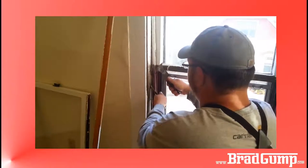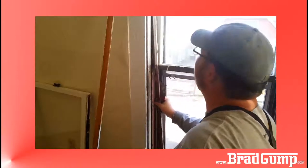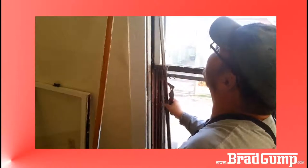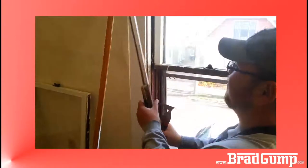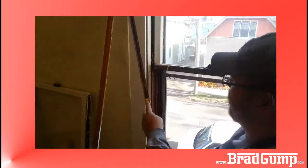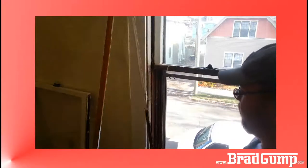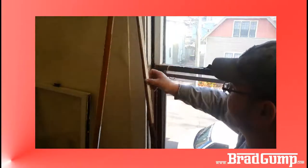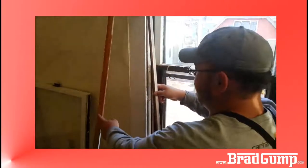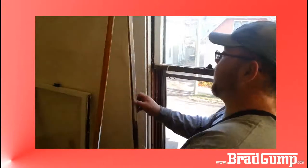That's what I'm talking about — now just wiggle it until it comes loose. Pull it out. She's been in there for years; it's black right there with dirt. Pretty much what I'll do is take my scrapers and blowtorch or whatever method I choose, strip all this paint off down to bare wood like the back of that piece is, so that I can then prime it and repaint it.